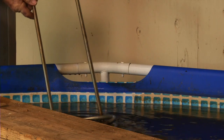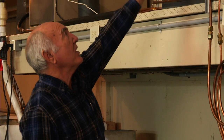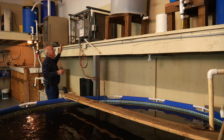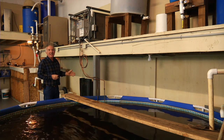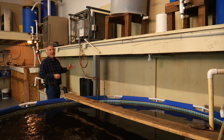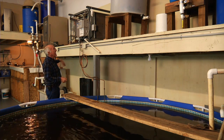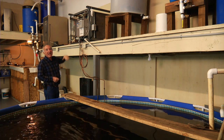Or, if the water is satisfied, another coil will put the heat into the air. The Freon is then cooled and recycled back in a continuous dehumidification loop. I can have a thermostat turn on one tank or two tanks, or a humidistat that will dehumidify.